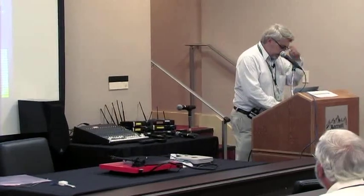Now, what I'm going to do is, I mentioned a little bit before about the quality of the audio that's on an LP record compared to CDs. One thing about CDs is that because they are sampling at 44.1 kilohertz, there's the Nyquist theorem, which means that you can't reproduce any frequencies in the original recording above half that sample rate, so 22.05 kilohertz. And in practice, it's going to be somewhat less because of the real-life digital filters. That's a brick wall filter, so there's nothing above about 22 kilohertz on a CD, nothing at all.